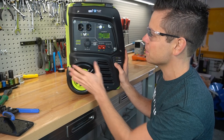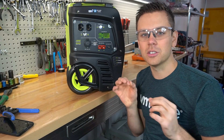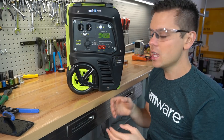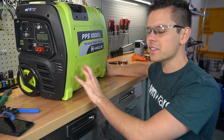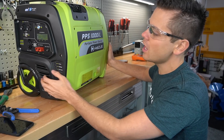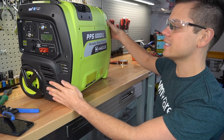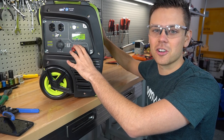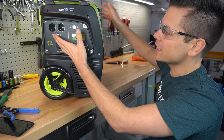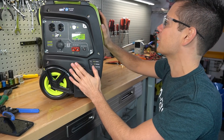Van and RV people will like it because it's on wheels and you can move it around, or if you have a stand at a farmer's market. The battery does not have low-temperature charging protection. It's great that they're using lithium iron phosphate, but the design could be improved. Having the AC input power supply connected to the DC converter system for battery charging via a big relay introduces so many conversion losses.